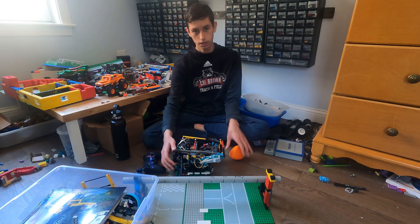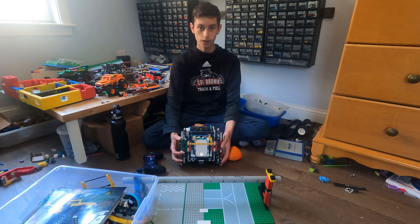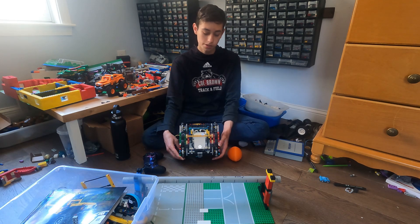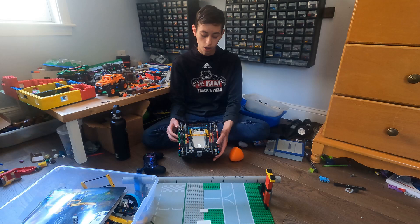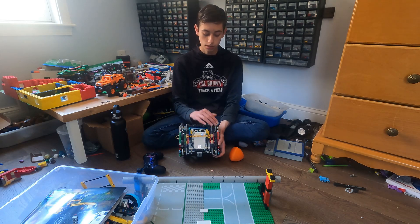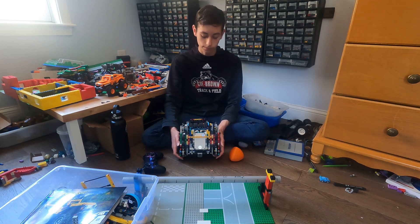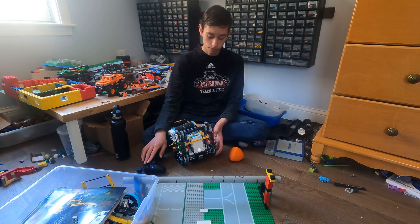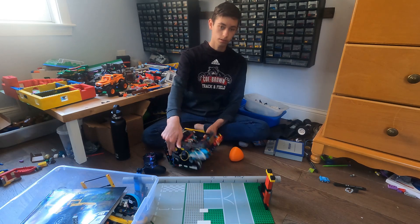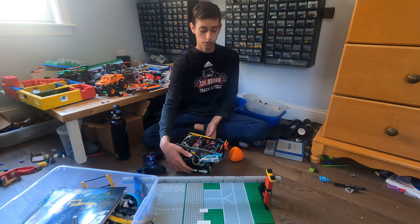The drivetrain just has one motor on each side. It's rather slow because it's Lego and it is one motor, but it has four omni wheels — they're only half omni wheels just so I could have them thinner. And then it has four traction wheels that go in the middle. These do scrape the ground when you turn, but it's not a big problem. The ones that aren't always touching the ground are also not a big problem because the center of gravity is close enough to the middle that it doesn't tip. You can see the gearing a bit — these move at about the same speed on the parts of the wheels that contact the ground, so there isn't really any weird pulling or pushing of the drivetrain, even though they are wheels of different sizes.